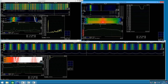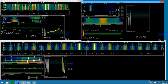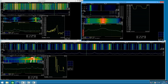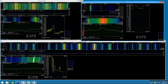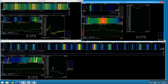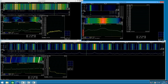And it doesn't help. It makes a small difference. I can hear it, but not well. So I have to reduce the interference level. So for the SDRplay, the level is now minus 40, 39.8, minus 40 dBm into the tuner. And that's the point where weak signals start to deteriorate. And it's similar for the BladeRF, but the permitted frequency spacing is quite a bit larger because of the wider filter.